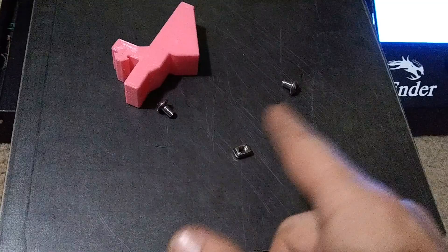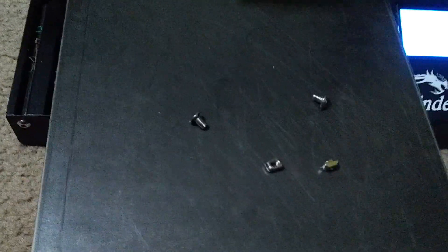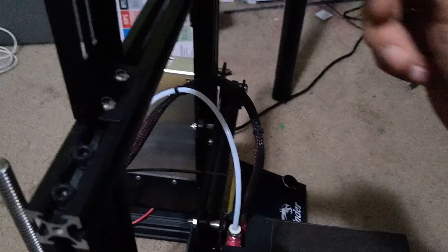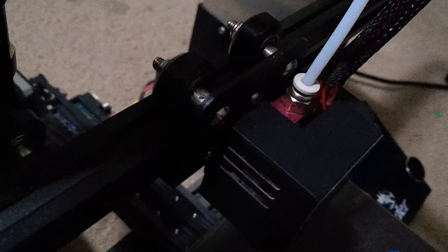I've retrieved my channel locking nuts and hex head screws from the side mount. We'll toss that aside and replace the spool holder at the top in the original position. I've got the spool holder back on, and I reversed it because the direct drive extruder is going to sit on this side just above the nozzle. I want the filament to go straight down into it and not through the back.